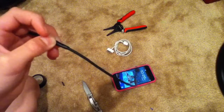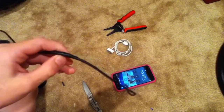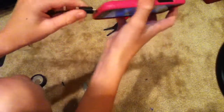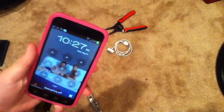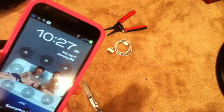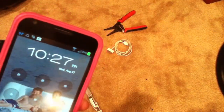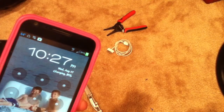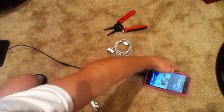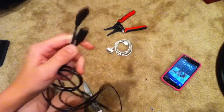I don't have access to a soldering iron, so I had to use electrical tape. But if I were you, I would solder it first, then put electrical tape to make sure the circuit is safe. Let's plug it in — and here we go, it is charging. If we unplug it and plug it back in, it says charging 89%. So yeah, that's how to extend a cable — pretty much any USB cable, just something that takes USB. I demonstrated this with micro USB.